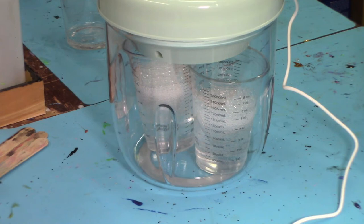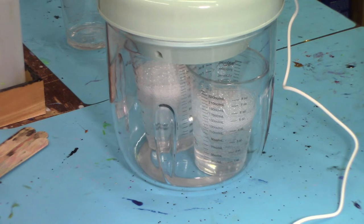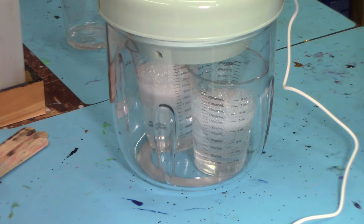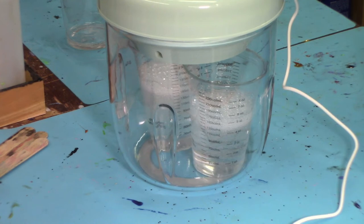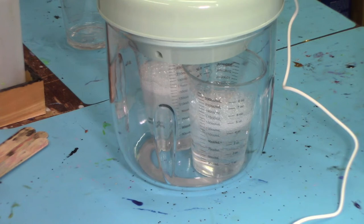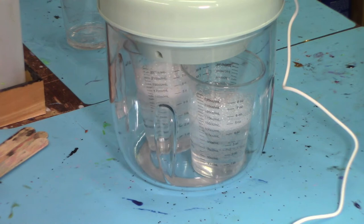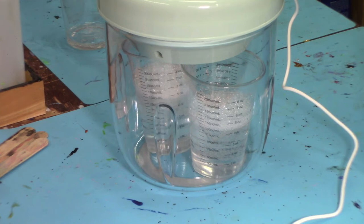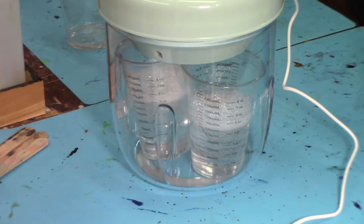Yeah, I usually use, on my vacuum pumps and all that kind of stuff, inches of mercury, HG, I think is what it is. Yeah. And mine usually goes to negative 25 here. So your elevation is going to change how that works. Generally, you're not going to get above 30, no matter where you're at, even at sea level. But I'm up in the mountains, so 25 is kind of my max.